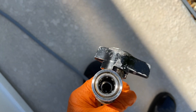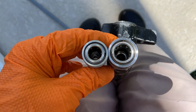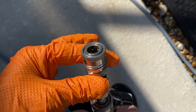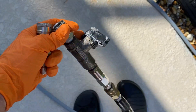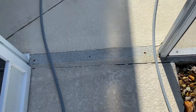You can see the orifice in comparison to the reducer — let me show you that one more time. This is what your high-pressure ball valve looks like, and this is what your reducer looks like. See the difference? This just goes on here, reduces your pressure, and you can put your J-rod on there or your M5 Twist on there. The only way to turn your water on and off is right here, but you won't be holding a gun all day long.